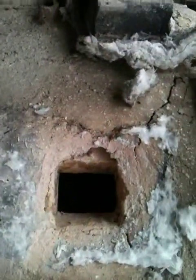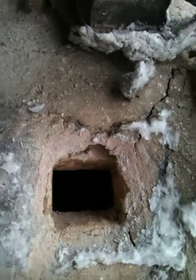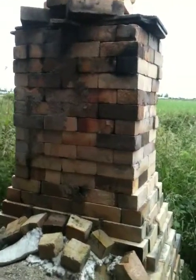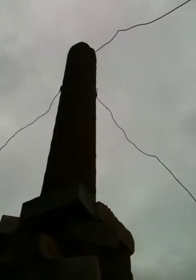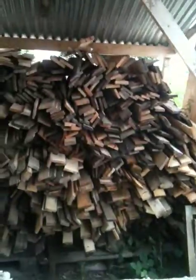Here you've got the side stoke holes on either side of the kiln, so that you can raise the temperature as you go higher up the firing. When you get towards 1200 degrees and upwards, the side stoke holes become very important. The chimney is very broad at the base but then it funnels up to a 10 to 12 inch cowling that goes up another 12 feet, giving you a 16 to 17 foot chimney.